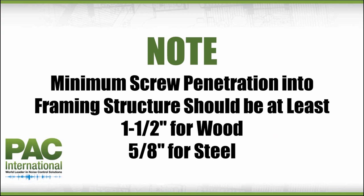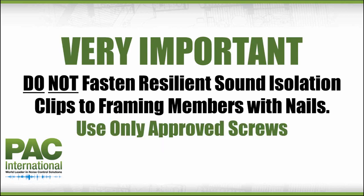Note: the minimum screw penetration in the framing structure should be at least 1.5 inches for wood and 5/8 inches for steel. Be sure to make appropriate adjustments if installing over existing drywall or gypsum board. You may have to use longer screws in this case. The screw length used is determined by the thickness of the existing drywall or gypsum board. Very important, do not fasten the resilient sound isolation clips to framing members with nails.